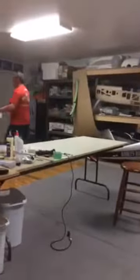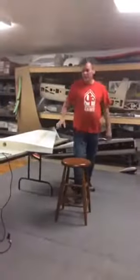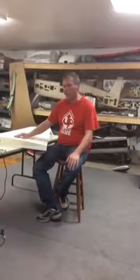Yep. Hey, guys, if there's anything I missed... What type of foam are you using? I use a 3/4 pound, 0.75, what they call grade A virgin. I have a place here in Salt Lake that manufactures it, and I buy it from them. Mine is 0.75 grade A. Now, grade C, when they cut it up into chunks for me, curved a lot. The reason they said C did that is because the moisture content was not as low as it needs to be, because it's construction grade. The guy even said it's kind of the crap grade. They can throw whatever they want in it.